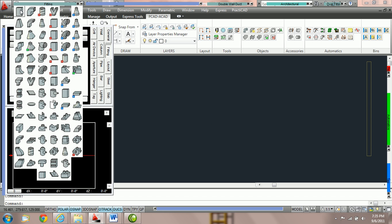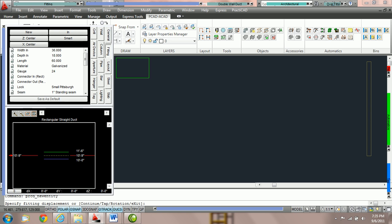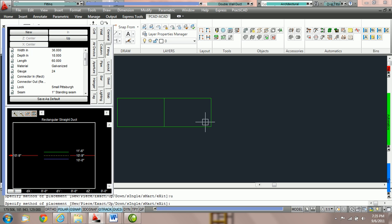The next routing methods are up and down, which are almost identical. Toggle through by typing U spacebar for the up method. Up basically rounds up to the nearest joint — notice that the second the crosshair gets past the connector out, Practicad puts a joint, rounding up to the nearest joint. Down, or D spacebar, does the exact opposite. Down doesn't put a joint until the crosshair is at least a full length joint away from the last connection, because it rounds down. So once I get past about 60 inches, it'll add a joint. I usually just use the up routing method, but both are offered.